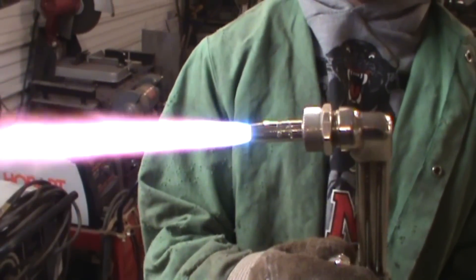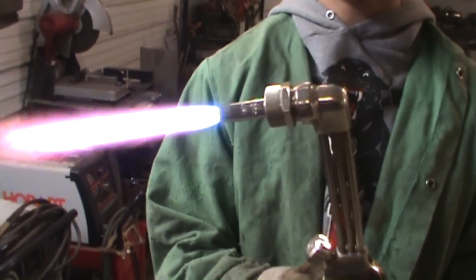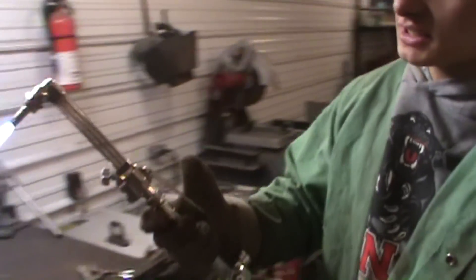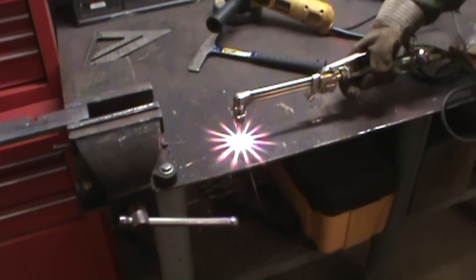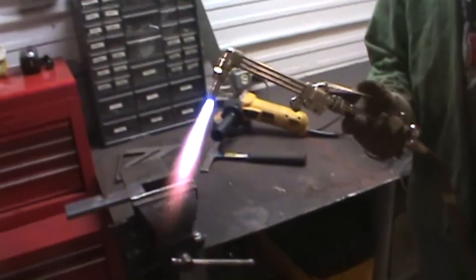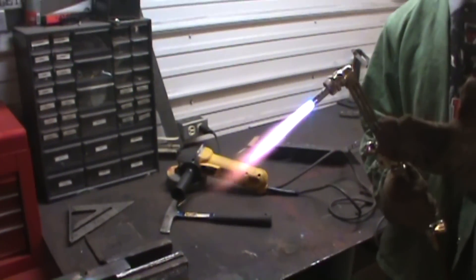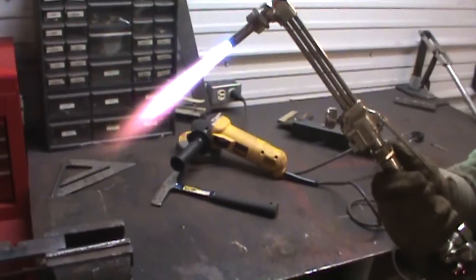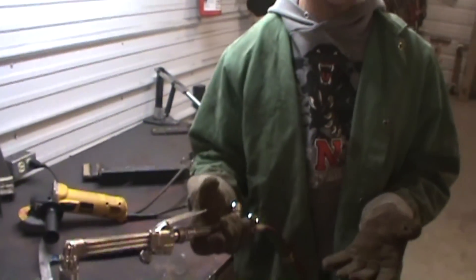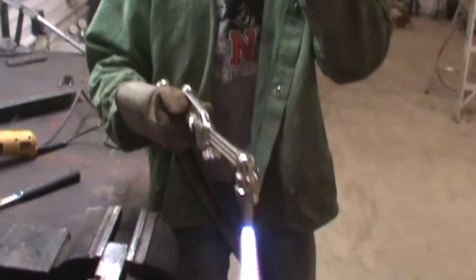So we need to turn it up. Add oxygen once, then normally twice. Add a little more fuel. You're going to hear that whirl sound — that's something you want to hear. When we set this on the table, you're going to see these kind of sharp, like star-shaped points — that's about what you want right there. Speaking from oxy-acetylene experience, that doesn't sound like a properly lit torch — it sounds like a rocket about to take off. Exactly. But this is not oxy-acetylene, that's a big misconception. This is what you want — you don't want that really low small flame. That goes back to the benefit of how much more oxygen flow we've got to use throughout this. You can hear the oxygen roaring out of there.